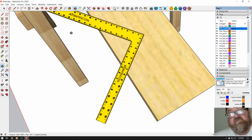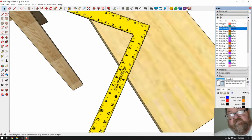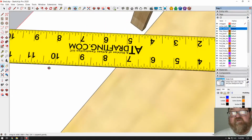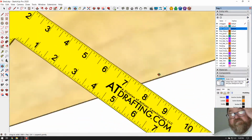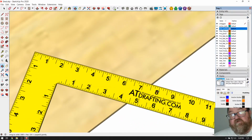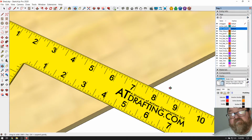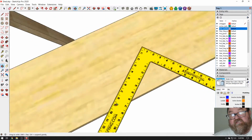My wife made me mess up. Somehow it got off 7. You see, it's very important to keep your framing square. And they make these little knobs you can screw onto your square that hold it at whatever you set it at, okay? But you want to keep that set at 7 and 7/16.